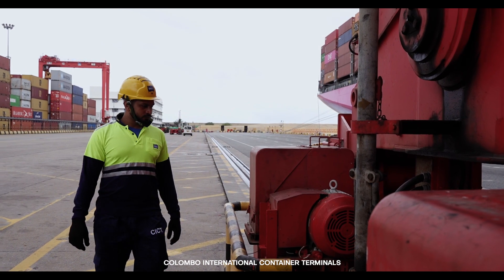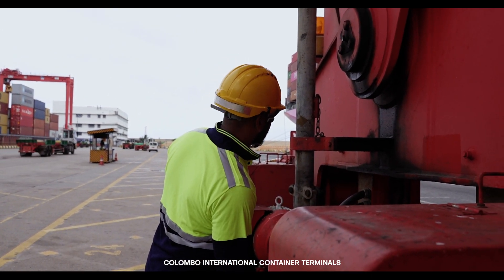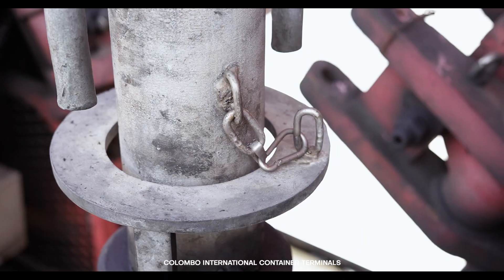It is essential to check the tie-down pins with particular attention to the two safety pins. Numerous accidents have occurred when tie-down pins collided with ground pits and other objects. This happens when the pin gradually moves downwards over time, causing the extended arm to strike the ground.